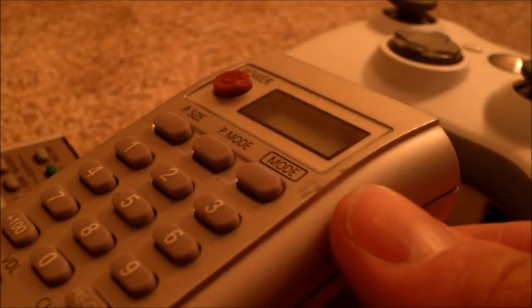So what you want to do is take your digital camera or your phone, put it in camera mode, and then hit a button and see if you see the infrared. If it's weak looking, change the batteries. But if you're not getting that, then your infrared sensor is dead. You can replace it with any other old remote controller you're not presently using — take it apart and steal the infrared sensor, which is kind of like an LED light, a light emitting diode, and put it in here and it should work.